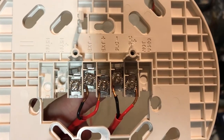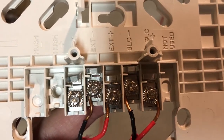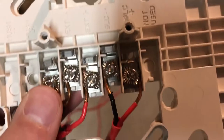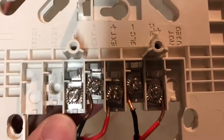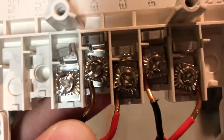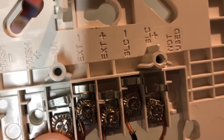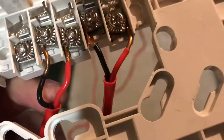Over here it's slightly quieter. We have SLC minus and SLC plus hooked up to one wire, and EXT minus and EXT plus hooked up to another wire. There's also a fifth terminal for interconnect if you choose to use it — some other options have hush buttons, but that doesn't work with this panel. You could hush the alarm by pushing a button on top of the sounder base unit or an external button. In any case, we have this set up to not interconnect with anything. The EXT terminals go to your 24-volt power or NAC, and the SLC terminals go to your SLC loop.